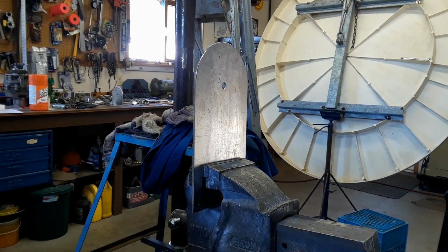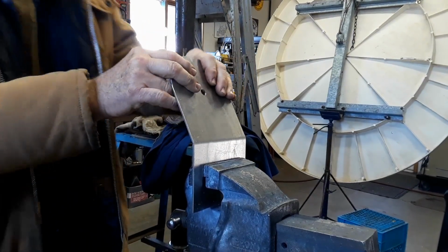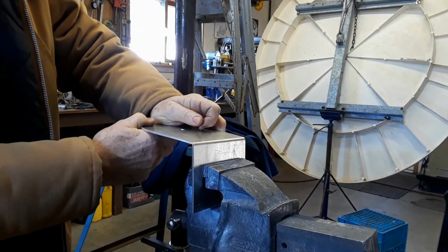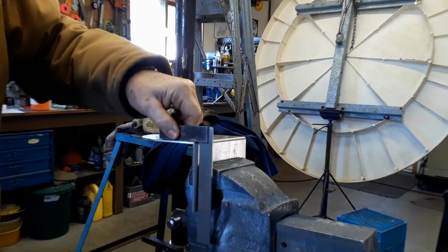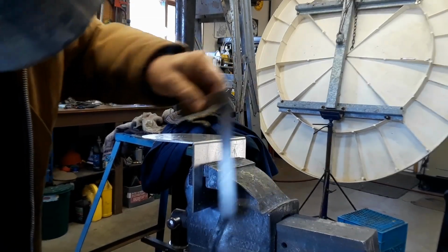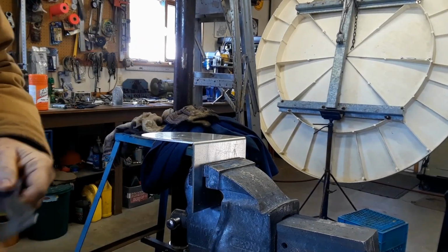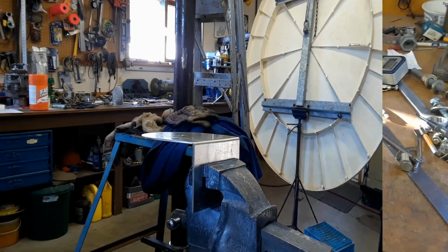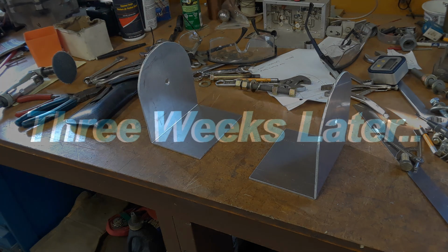Next I take that piece of aluminum and I stick it in a vise and very carefully bend it, and where the notch is I get a nice square even right angle bend, depending how far I go with it, of course. The aluminum still has lots of strength, and if I find it's too weak where I bent it, I can always just tack weld it a bit with the aluminum welder. So that's how it's done without a big metal brake. 1/8 inch is pretty hard to bend even in a brake. I've done right angles like this with different thicknesses, even up to 1/4 inch.